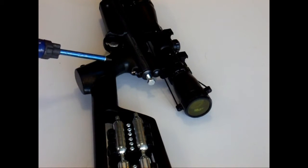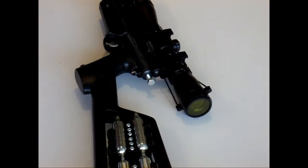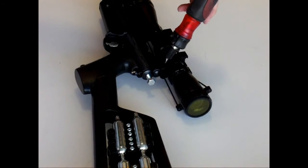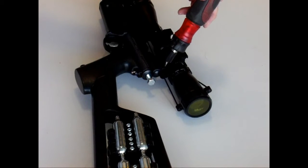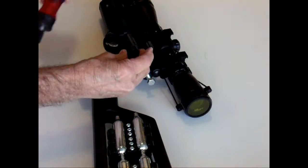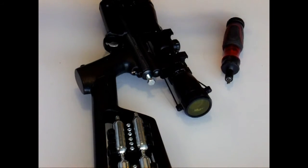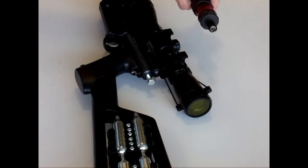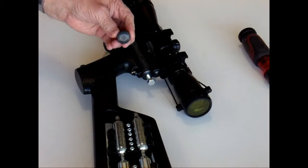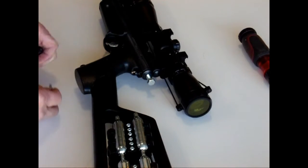After you've removed your stock or your hand grip, you should be able to unscrew that screw. There's another screw on the top of your breech that on this gun is located underneath my scope mount right here. But it goes through the top of the breech, it goes through this small plug right here, and it goes into the large tube plug. This one on the top here is a regular flat tip screw. After you remove those 2 screws, the tube plug and the spring, you should be able to take out from the back of the large tube.